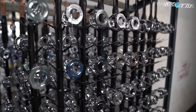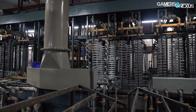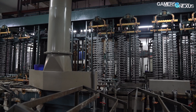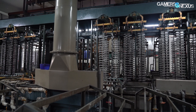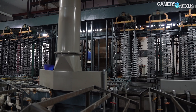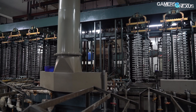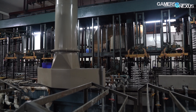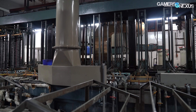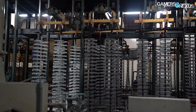Thorough cleaning is absolutely vital for electroplating to work, so each rack gets dunked into four separate cleaning agents. Each dip lasts up to two minutes, followed by a water rinse and the next chemical, for a total cleaning time of about eight minutes. Since the soaking time required for all chemicals is equal, the conveyor chain dips all the racks on the line into their respective chemicals at the same time, so every part of the cleaning process is constantly happening simultaneously and doesn't require the same degree of manual oversight as the anodization factory water tanks we saw previously.